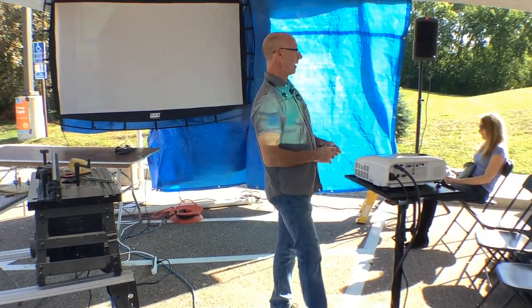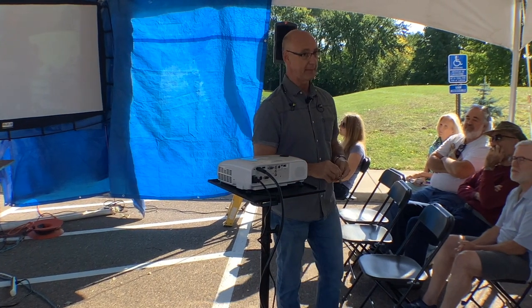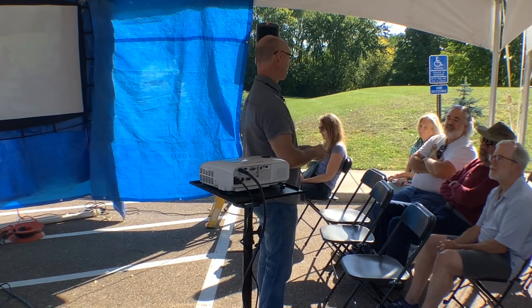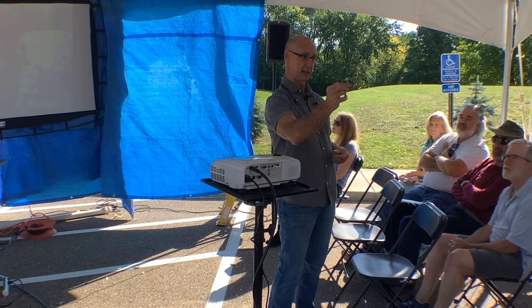I love making lock rabbet joints. It's a tiny bit fussy to set up, but it beats the heck out of a drawer lock bit or a lock miter bit. And once you do it a couple times, it's going to go fast for you. So we're going to do everything with a slot cutter, in this case, a quarter inch slot cutter.